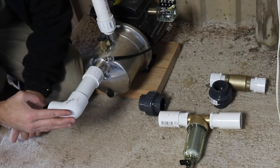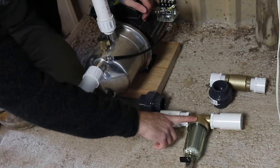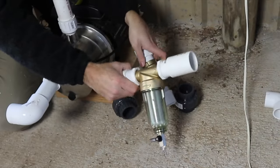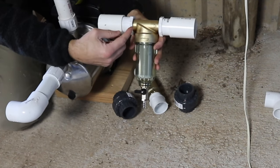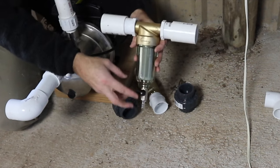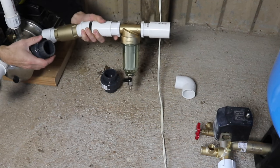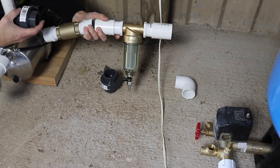From our rainwater tanks, we have the supply side into our jet pump and then pressure out of the jet pump. That will incorporate a few different items. First is this check valve — that's a safety piece so we don't get any pressure back into the jet pump in reverse. The next thing is this spin-down filter. Instead of a media filter, this will catch any sediment that gets through my pump from the tank and keeps it from going out through my irrigation lines. Those will be in-line here, and to service them I'm going to have threaded unions on both sides, between the pump and the tank.